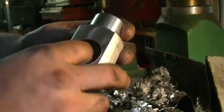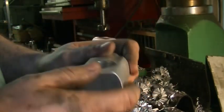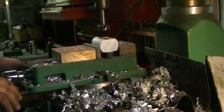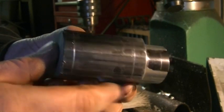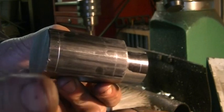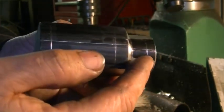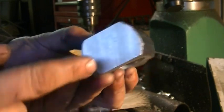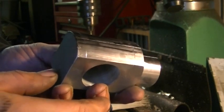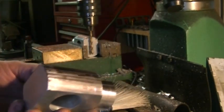There is the part - the hole looks good. I like the spacing of it, it's right where it's supposed to be. The next step is to drill the holes - these are going to be a number seven drill bit, or the fractional equivalent is 13/64ths. I'm going to be drilling three of those holes: two through the body itself and one for a set screw on top. I've already got my first piece set up inside the mill and I'm going to go ahead and drill it out.